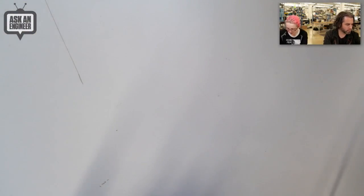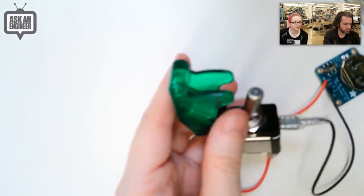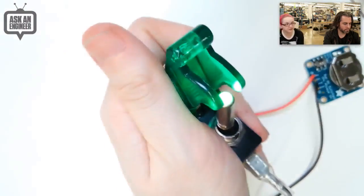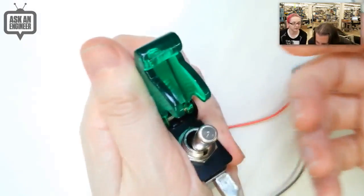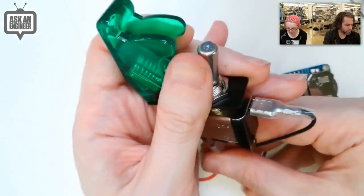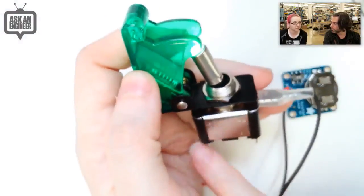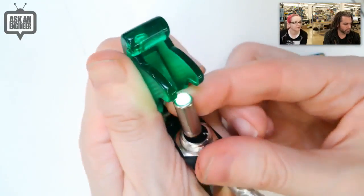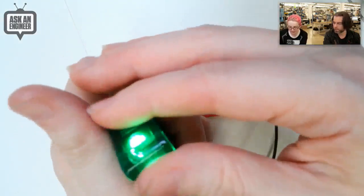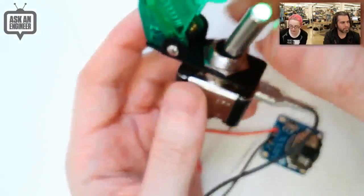So this is a sample. Let me back this up a little bit. I have it set up so when it's flicked on like this, it's lit. And then when you turn it off, it's off. But you don't actually have to do it that way — you can make it so the LED is always on, and use the toggle switch by connecting between these two pins.